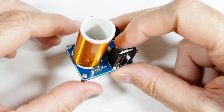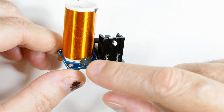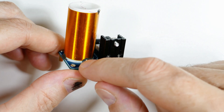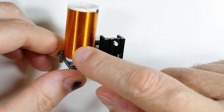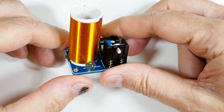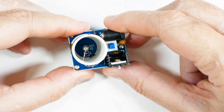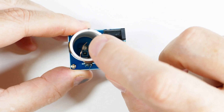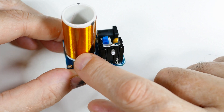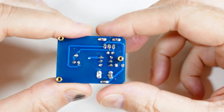Right underneath the coil you can see two white circles — those are a coil, and so this is actually a transformer. The oscillator is driving a current through that lower printed circuit board, which is a double-loop coil, inducing a voltage that increases as it goes up the wire coil until it comes out at that little wire at the very top — that's the electrode. At the bottom you can barely see the LED and the spot where the bottom of the coil is soldered into the circuit.